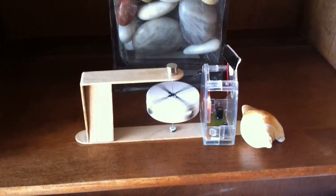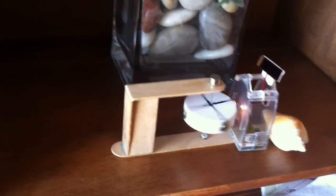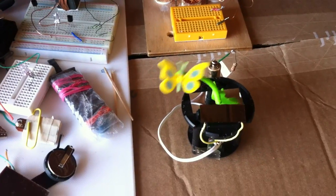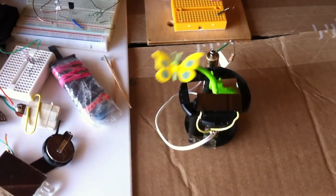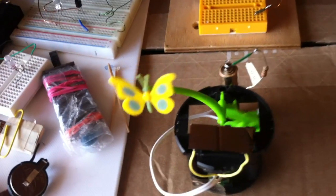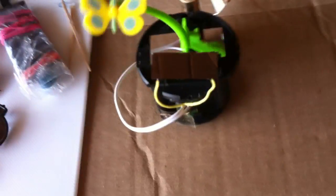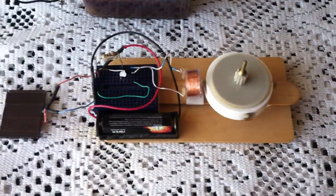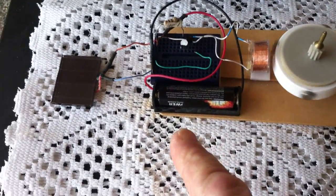This is just a solar operated one that uses that really nifty little solar waver. And that's the easiest way to go if you want to just do a quick and dirty. Get a dollar store waver and put a 1.5 volt battery on it with a 30K resistor in series with it, and then just tie it right into the solar panel, and that'll run for a long time. And then this one here, I'm just going to let this sit here until the battery bursts.